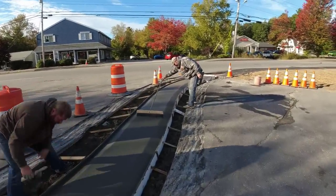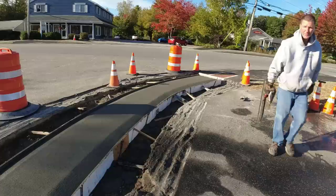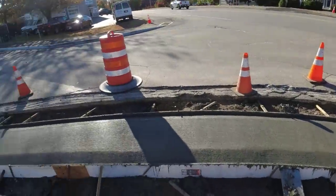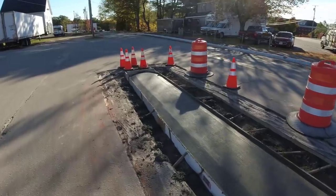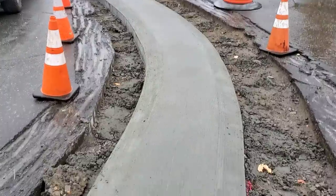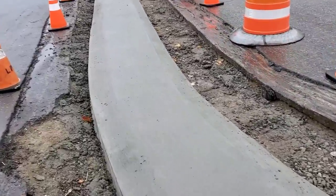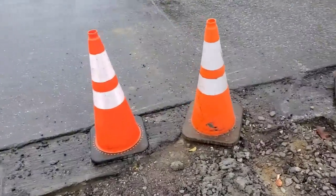You can see how nice, neat, and clean that looks where the edges blend into the flat part up top. We've magged out the edges, broomed the edges, magged the top as we go, and Darren's following behind getting the top broomed out. That's what they want — broom finish, flat on top, beveled edges — and they're going to pave right up to our bevel. The next day it was raining but we had to get the forms off so they could start grading for the paving. We stripped everything off and that's kind of what it looks like after the forms are removed.